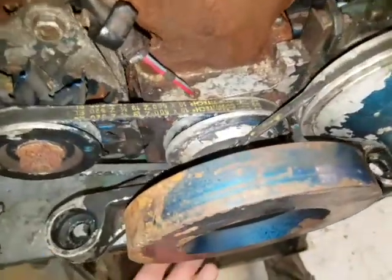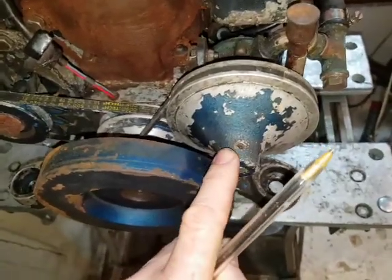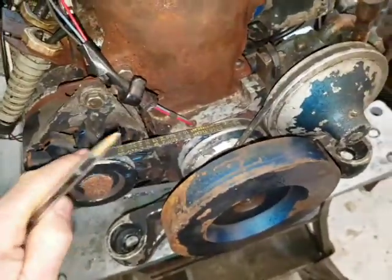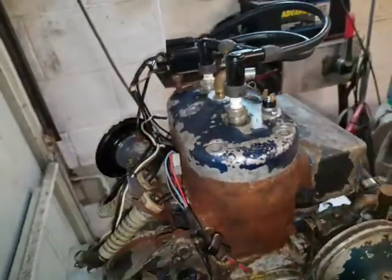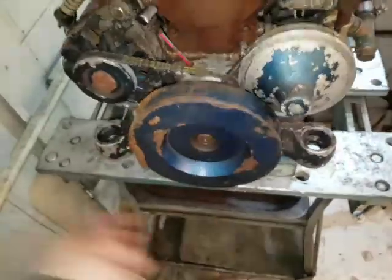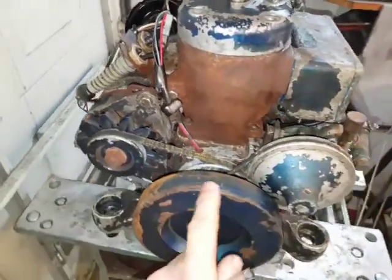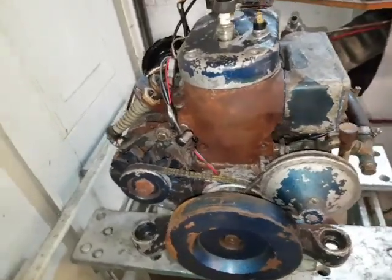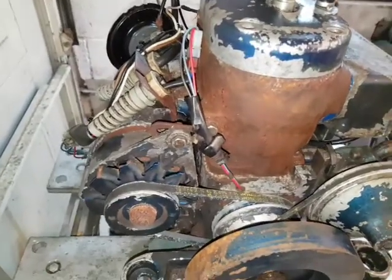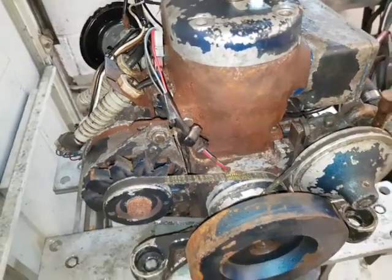So I imagine you wrap some cloth around here a few times and hope it doesn't get caught in this pump. You've got a huge load of an alternator in here geared up, and 2 cylinders to fight against instead of 1. So with the Vire you can get the thing just after top dead centre and pull it round quite easily. But with this being a twin, there isn't an easy third of a rev or so. You can't go round 2/3 till you hit compression. It's going to be maybe easier. Could be more difficult though, I think, to pull start. So there's that issue.